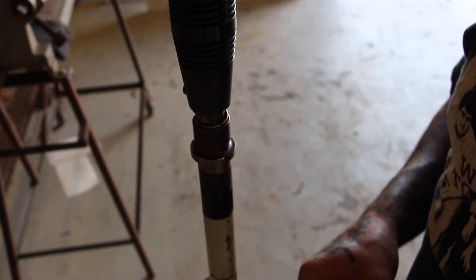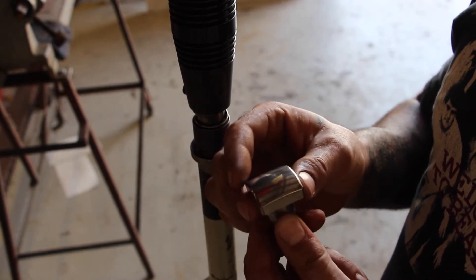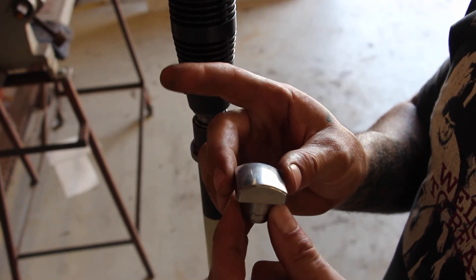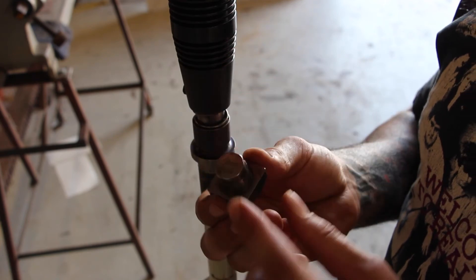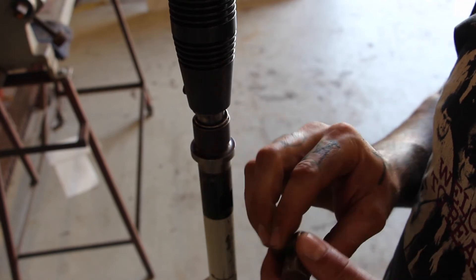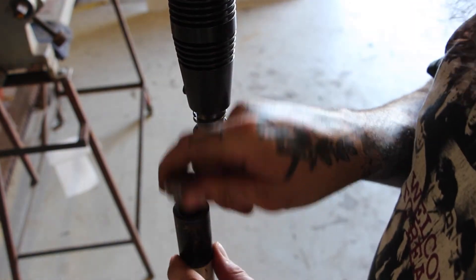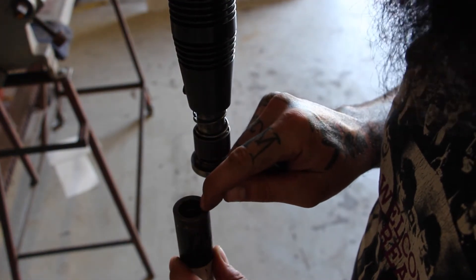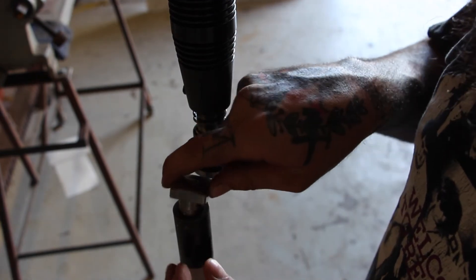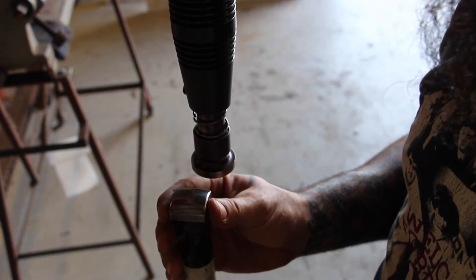One of the great features about this machine is the capability of running asymmetrical dies. For instance, this is a dual crown die from one of the sets available. What makes this special is the machining process of these dies, where the post of the die is actually cut to the shape of an octagon. At the bottom of both tool holders, there's the opposite cutout — an octagon-shaped hole inside the opening. Therefore, you have the capability of locking the die into place without a concern of rotating or spinning while planishing.